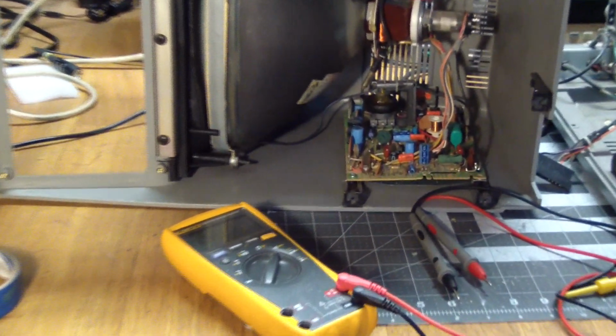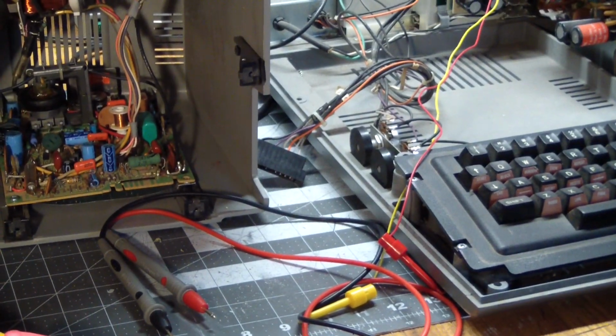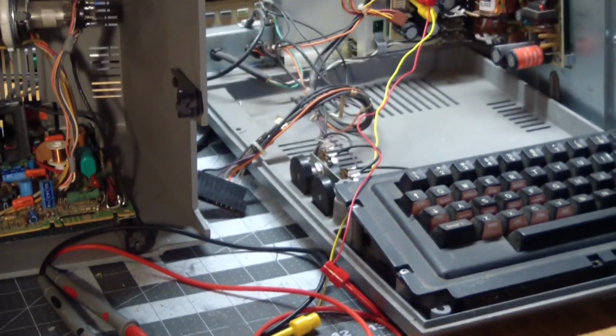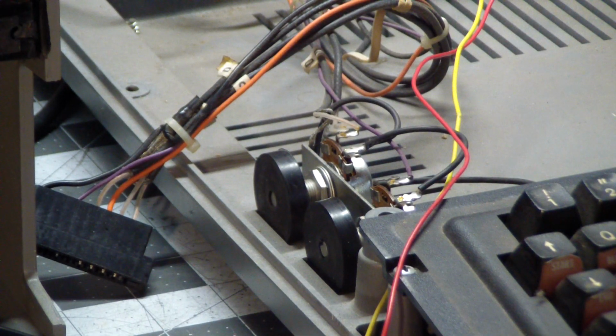So here's where we're at. That pigtail fuse in the monitor is blown. And I should have remembered this, but it has two power supplies. Identical power supplies. This one has some life in it. That one is completely dead. And finally, while I was at it, I had a closer look at the brightness and contrast controls, and they are completely frozen. So, well, I guess we should take out power supplies, bench power them, and see if we can find what's wrong with them.